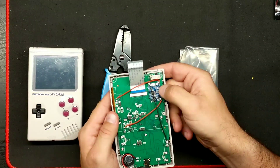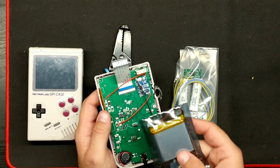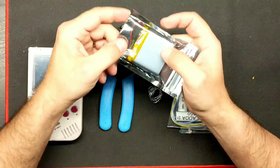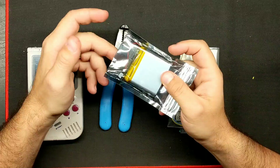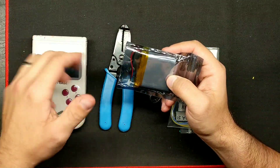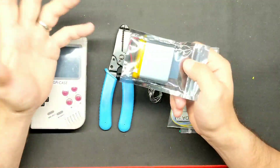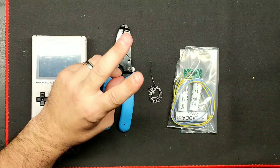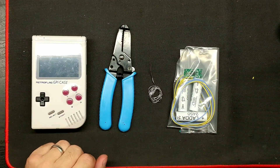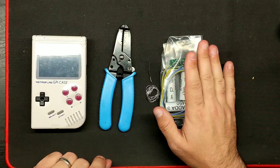This is completely different to a LiPo circuit that most of you have used. The one you usually see is connected to a lithium ion polymer battery. The issue I have with LiPo batteries is a few — they're prone to shock, not having very good shock resistance. If you drop your case or something shocks it, the possibility of damage is very high. They tend to balloon up and then explode or leak. I've actually had two customers have that happen to them, and I replaced them because they bought the kit as a whole from me.